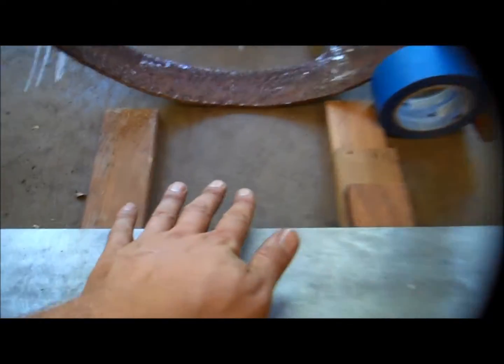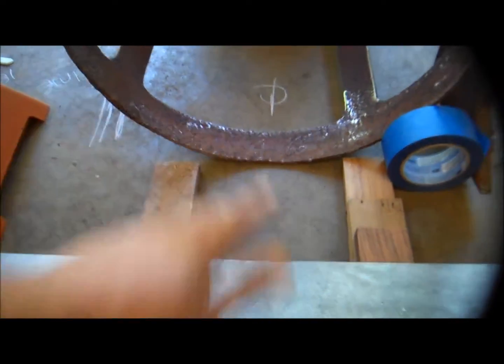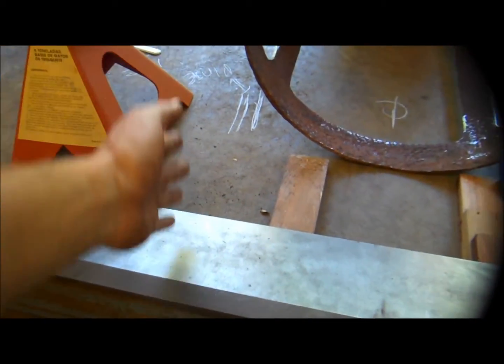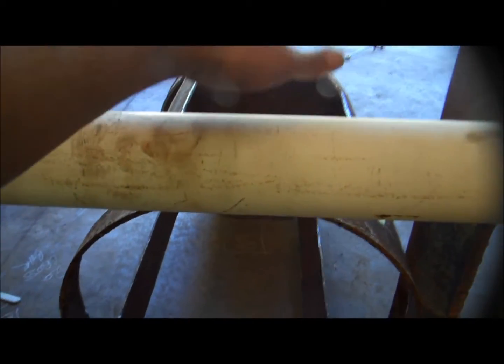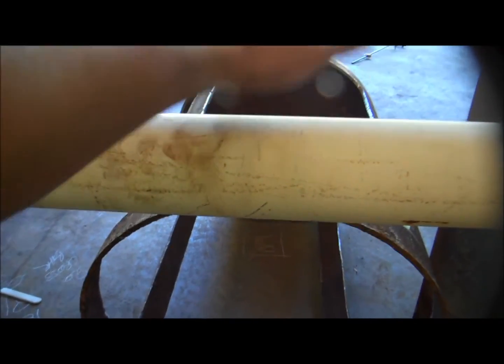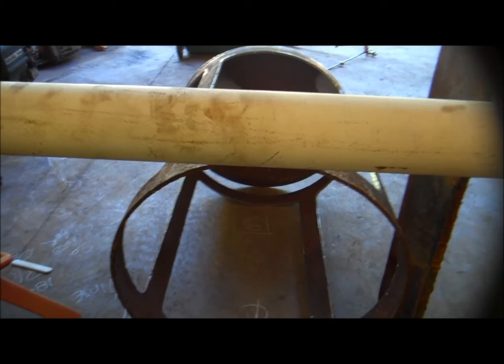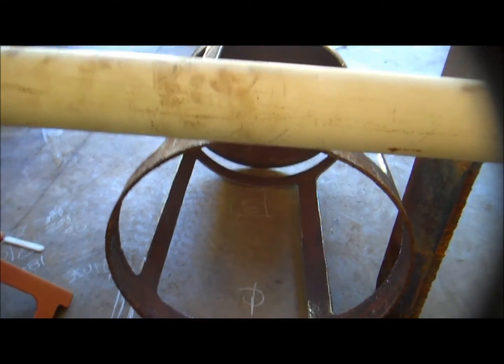I've just got to make a plate that's angled to the shape of the drum in the front, off this cutting edge. And I'll have half-inch side plates to tie everything together. I'm not sure about the coupler — I'll probably put it close to the front here like a normal bucket, because that's where I need all the force up at the cutting edge.